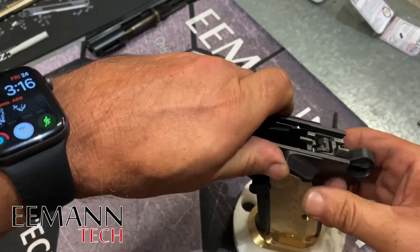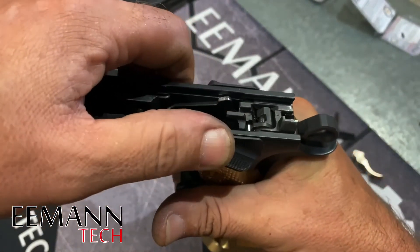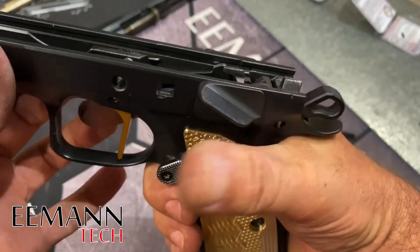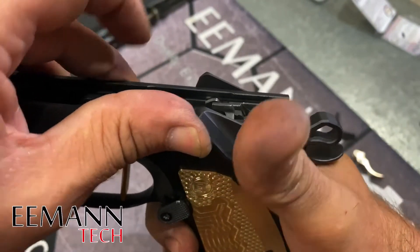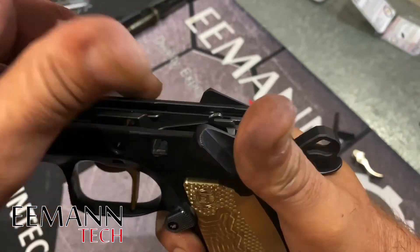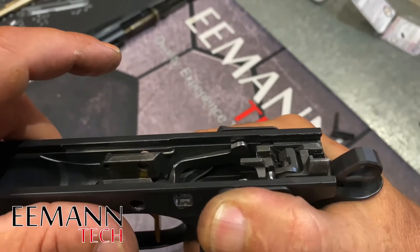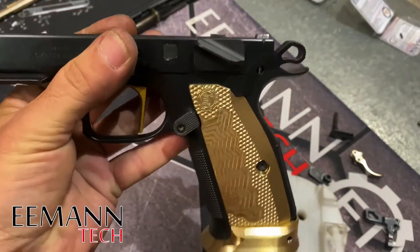Almost there. Now we've eliminated the problem — when we turn it off we're not getting the bump. It's not bumping and dropping the hammer, which would have caused an AD and a possible disqualification if it hadn't been tested or if it was borderline and just started to go wrong on the line. We are now at a place where it's pretty much working. There's no play in the hammer and no bump when I disengage the safety — I'm pretty happy with that. It's been fitted correctly, preventing that leg of the sear from dropping down when we press the trigger and blocking it from falling, and when we disengage the hammer's not falling. Thanks for watching — that's how you install a safety catch, see you later.